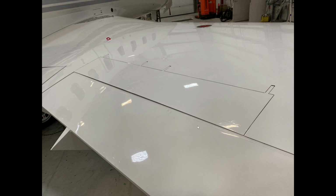And this could be referred to as one of the quiet areas of the top of the wing, meaning this could be an area where excess type 4 or type 1 icing or anti-icing fluid could trap in here. It's a very common thing to have these stick a little bit. If moisture gets into here, the hydraulic pressure would normally be enough to pop them open.